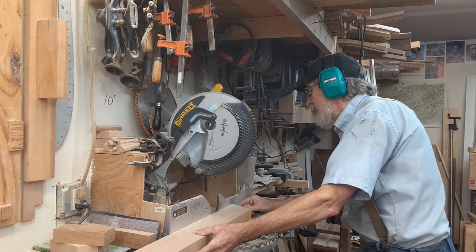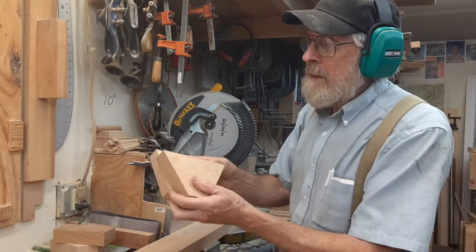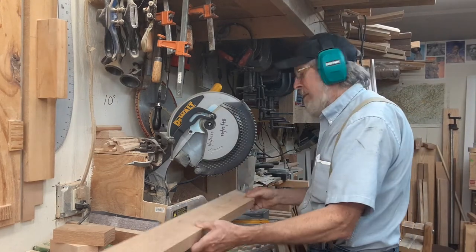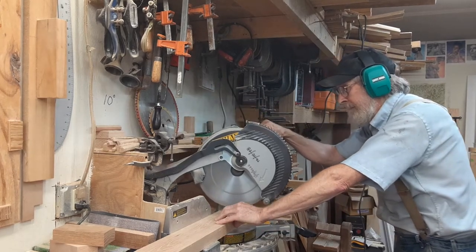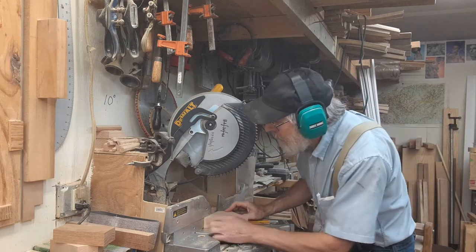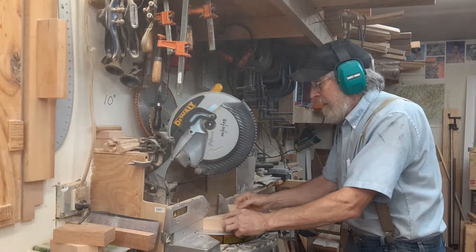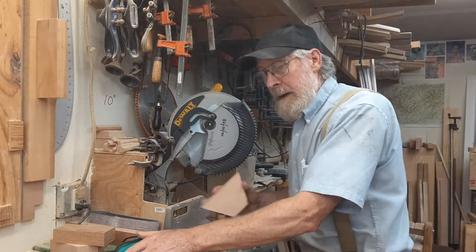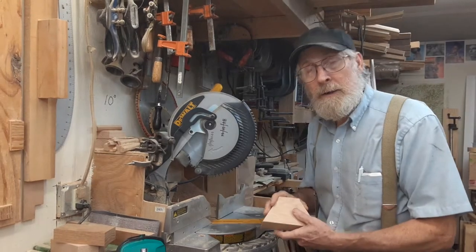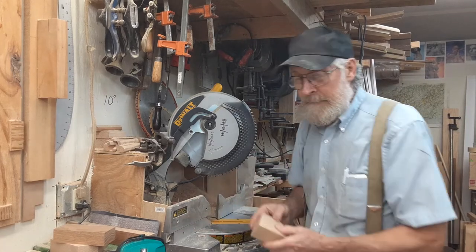Put the long point right over here — six inches. There you can see that that piece is a little bit wider than this piece. I'll cut another one just to show you. I flipped the board over with the long point right there, six inches. I can just turn that piece and go to my mark right there. And there I've got my piece that's just the same size as that one. That last cut looked dangerous on camera, but it's not that dangerous — I'm outside of my yellow line, pushing against there, so I feel pretty safe about it.